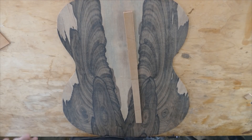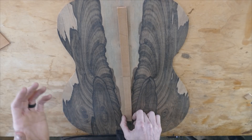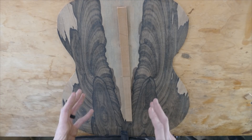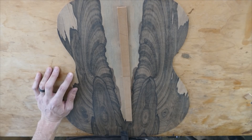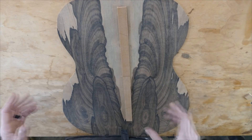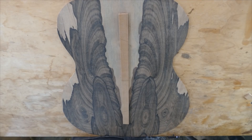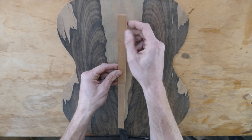This is one of the few areas, as far as the parts for my guitars, where I can be a little opportunistic and actually use scraps around the shop — pulling the scrap pieces off of the bookmatch sets. Otherwise, I tend not to repurpose scraps in guitars because I like to work with a lot of intent, being very purposeful about picking out the different woods that make up the color and grain motif of the instrument. However, with the backstrip, it's going to be on the inside of the guitar and doesn't really impact the tone, especially since it's on the backplate and not the top. So use whatever scrap wood you have and cut it into small strips with the grain running across width-wise rather than length-wise.